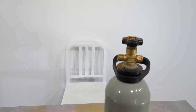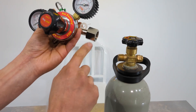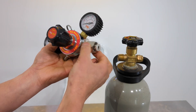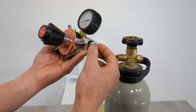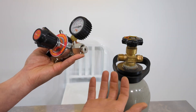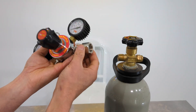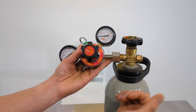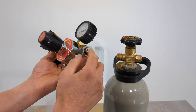If you look at the older regulators like the Mark IVs, or most regulators out there in the market, they require you to do it up with a nut. The reason a nut is required is because they use fairly hard nylon washers. These nylon washers are a hard compound — hard-wearing and long-lasting — however from our experience they wear out generally because people over-tighten them. Once you put a nut on and get people to tighten it up, the temptation is to get a spanner, get a lot of leverage, and do it up overly tight, which damages the nylon washer.